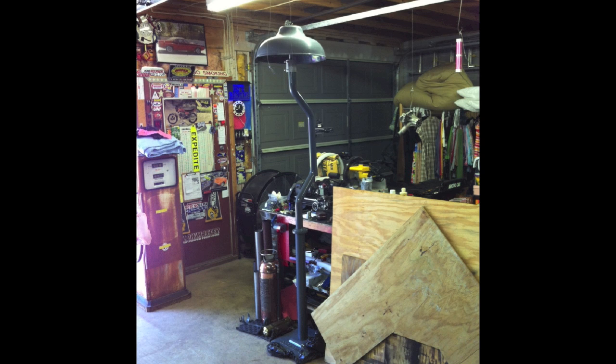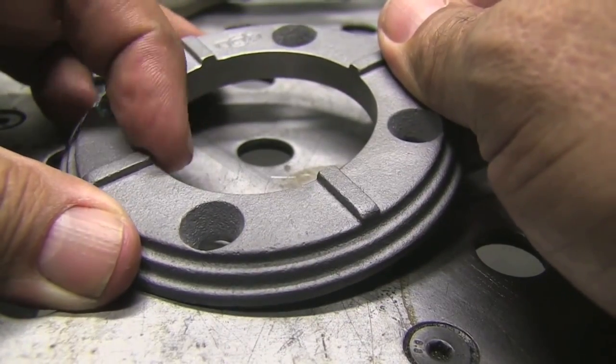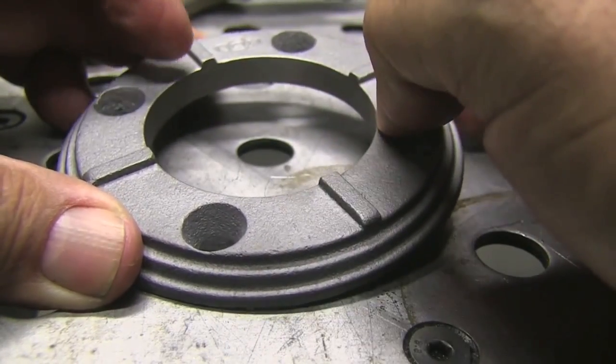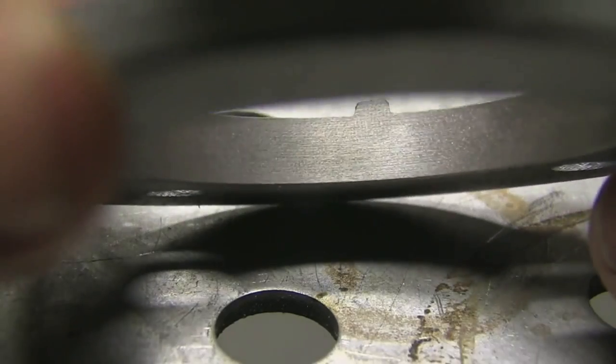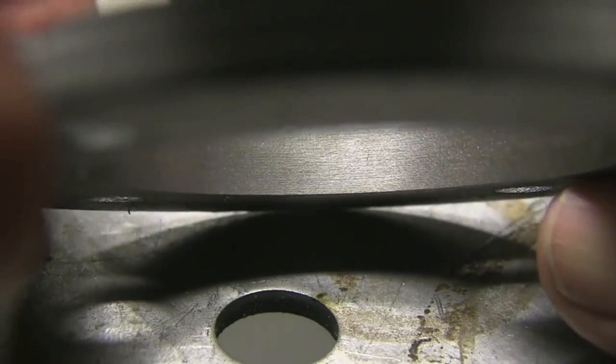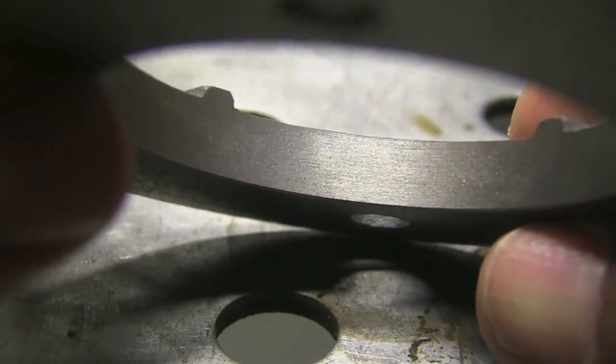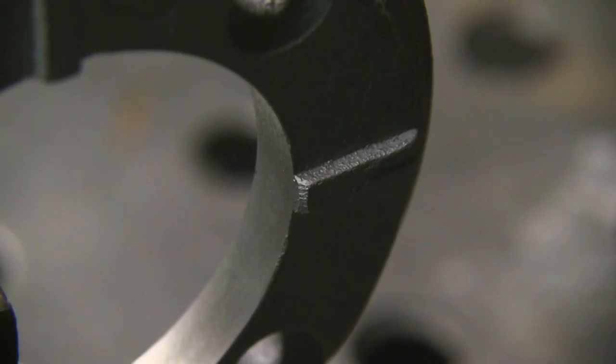I did this little job a while back for a guy restoring an old gas slash lamp. He gave me this cast iron flange — at least he said he thought it was cast iron. It's an original flange, but we're welding it to 409 steel pipe — it was the only material he could find that was the right diameter to slip in there, and he even had to turn it on a lathe a little bit.